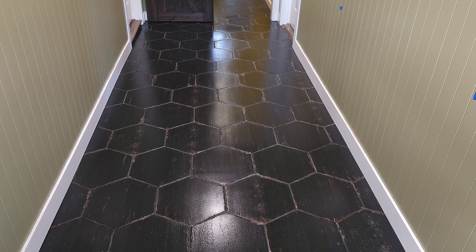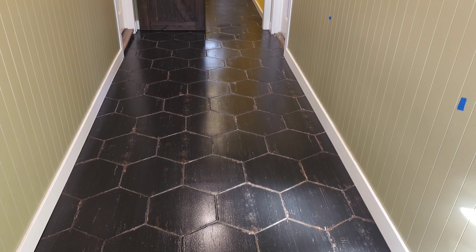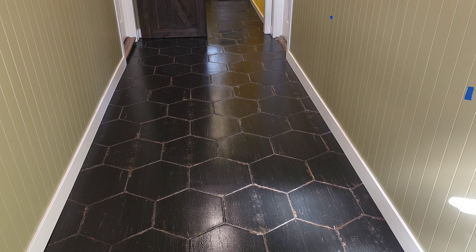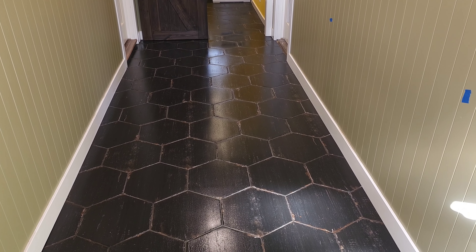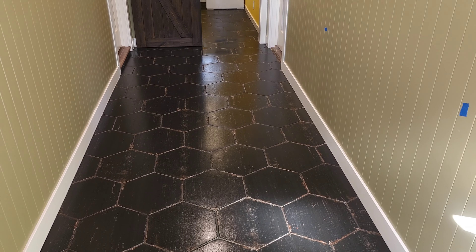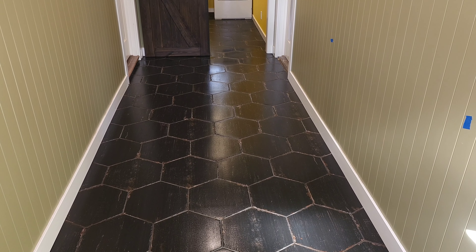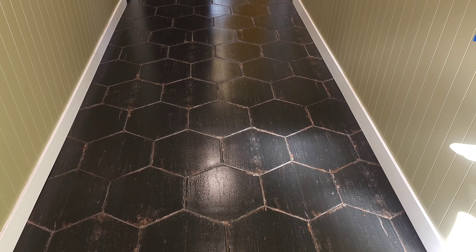That way if somebody runs into a problem like this, maybe they'll come across this video and be glad they saw it. Because it was a learning experience for me too, finding out how to get this stuff to come off a tile like this. So a little recap: I vacuumed the floor first, then applied a diluted acid cleaner. I did the edges with a scrub brush with a stripping pad on the bottom, and then used the buffer with the stripping pad across the rest of the floor. Then I rinsed it off using a little over a thousand PSI and warm water, let it dry out, and what you're seeing now is sealing it.